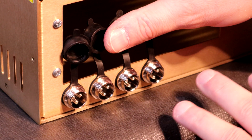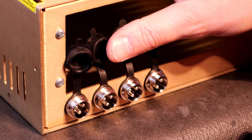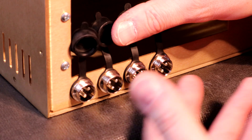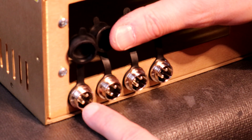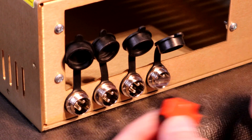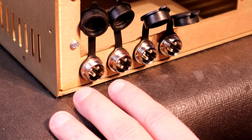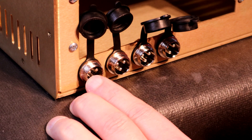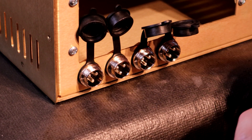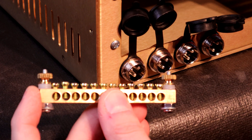This chassis is virtually endless for those who want something completely updatable at later periods, even if they're not using everything right away. We're using our 3-pin GX16 for switches — two pins are allocated to the switch itself. Switches are included with this chassis; you'll be receiving four snap switches. Pin one and pin two are typically allocated to switch terminals, and pin three is allocated to your shield drain, which is your ground. You're going to need a ground bar, and that's included. This will mount inside the chassis wherever you choose.